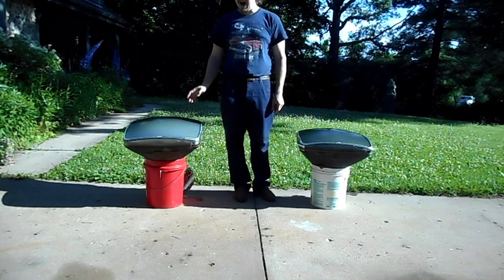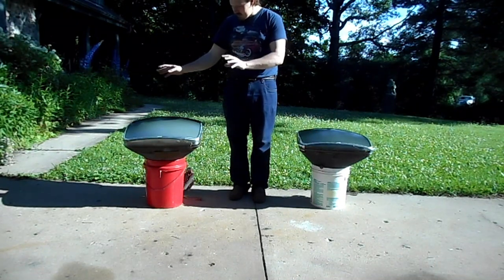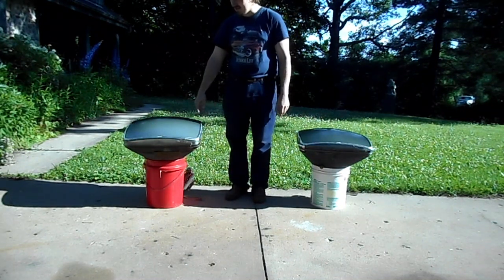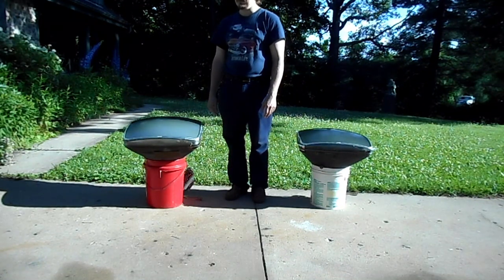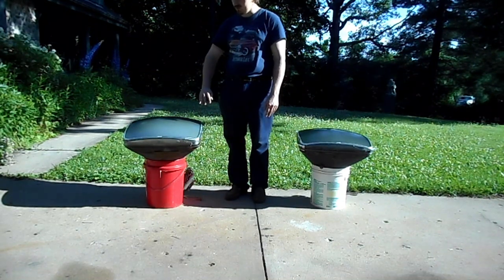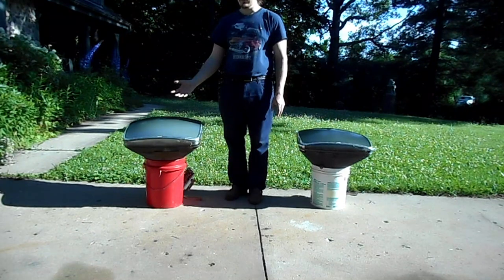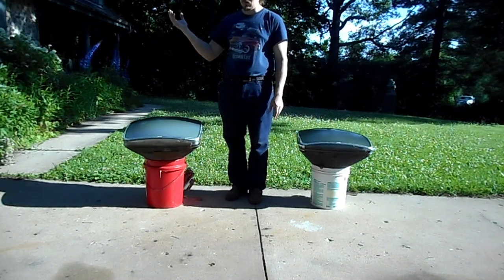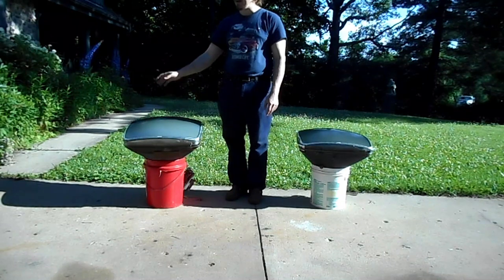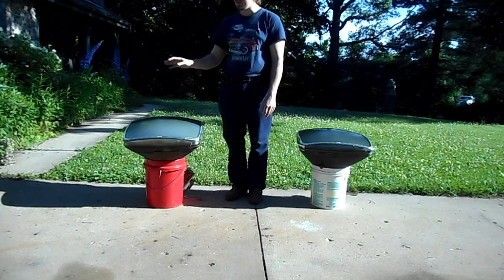Zenith type cataract removal, as long as you're careful not to neck the CRT, handle it excessively roughly, as long as you don't subject it to large mechanical shock and you don't get crazy and start trying to heat the tube up, Zenith cataract removals are pretty much safe. I don't ever bother wearing any safety equipment when doing Zenith style cataract removal. You can do a Zenith type cataract removal on a 45 degree fall evening with just lighting from outdoor lights, with no sun, no nothing, and the Zenith cataract removal will work. You don't have to heat the tube or subject it to any thermal gradients that might cause hazard. So Zenith cataract removal is really safe.